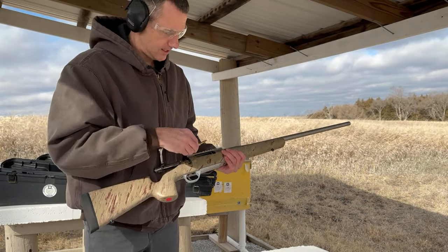Now that I have my two standard cases, I know how to set up all my equipment and can go ahead and load and fire form all the remaining pieces of brass. That leads to the last step — step ten: once all these pieces are fire formed, I'm going to re-anneal everything. That takes some of the stress out of the brass — the Ackley moved quite a bit, the 30 BR less so, but there's still a lot of stress put into the case. Annealing relieves that stress and will help fully shape the shoulder on the following firings.